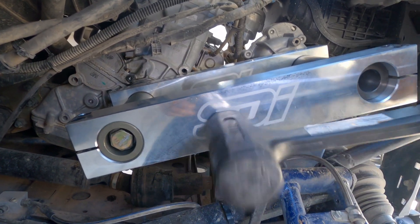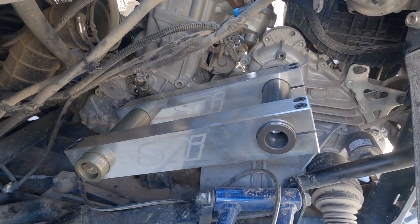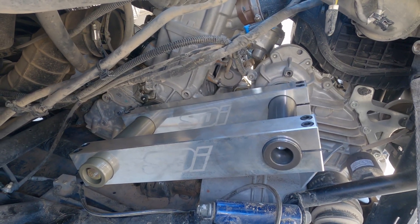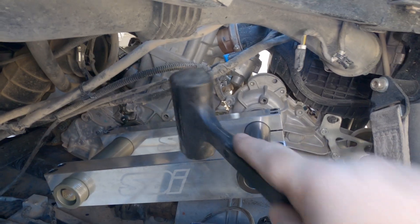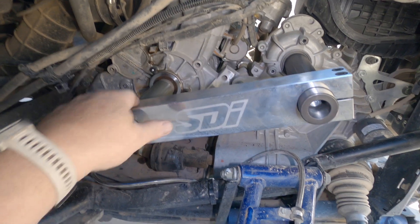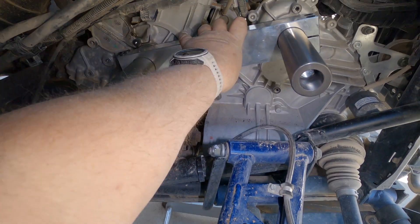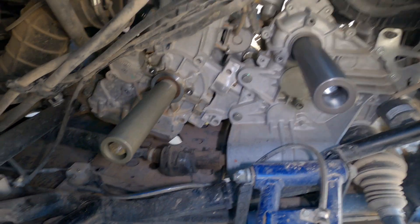Now let's just tap this thing. So what this does is this makes sure that both those two round tubes — attached to the output shaft of the engine and the input shaft of the transmission — are going to make sure that those two shafts are parallel. Now I'll tighten up these allens and then tighten the engine up and pull them off and we should be in alignment. Now that I've already aligned it and torqued everything back down, this thing should be able to slide back and forth without any kind of effort. So we are in alignment.